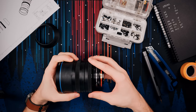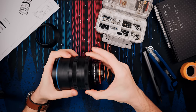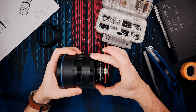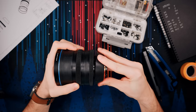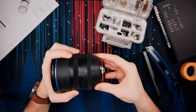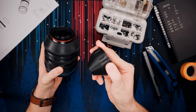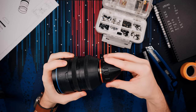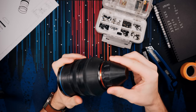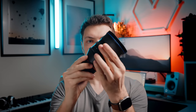Screw in the front element with the step-up rings, which you can use to line up the screw holes — I find it more aesthetically pleasing when they're on the top. Grab your 12mm screws and screw them into the focus ring — it just needs to bite into the tape. The focus ring should spin freely without too much friction or too much of a gap. If there is friction or a gap, it means one of the rings isn't level. Finally, slide the aperture ring through the back, make sure it spins properly, then grab the adapter cover and snap it onto the adapter. We're basically done — the lens spins, it focuses, it changes the aperture, and it looks awesome.